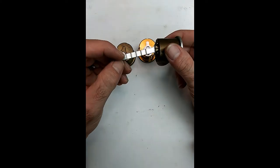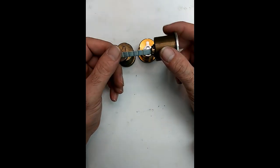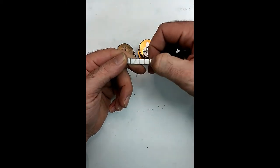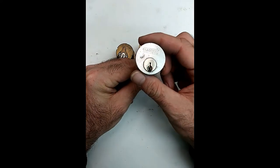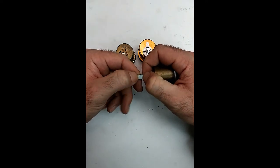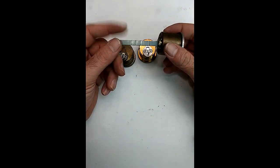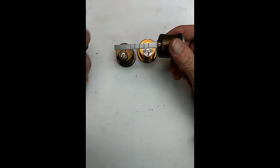The tailpieces on the back typically have these notches, which are easy cut marks. This tailpiece has not been cut — it's a fresh one out of the box. The easy way to cut these is to take a pair of pliers or vice grips, hold one side, and then take the other and snap it. Always, if you are unsure of where to cut, snap it at your best guess and see how it works, because you can always add a tailpiece to make up the distance. If that doesn't work, come back and cut further. The cost on this piece is trivial — somewhere around a dollar and some change — it's just more of an inconvenience.